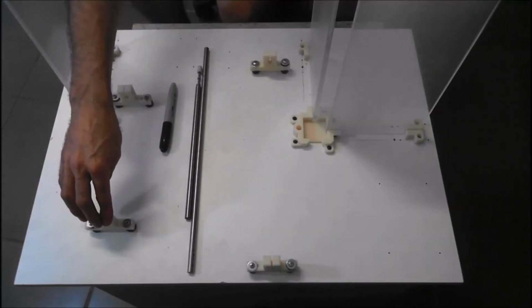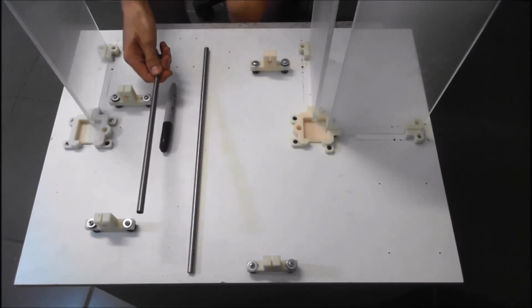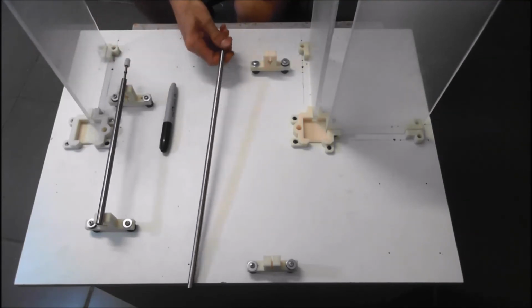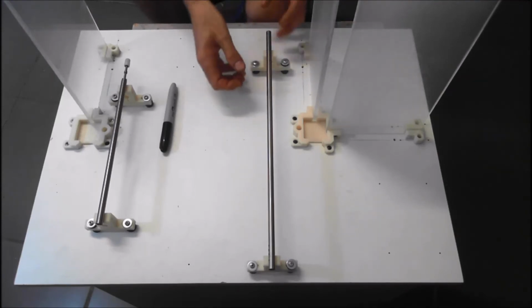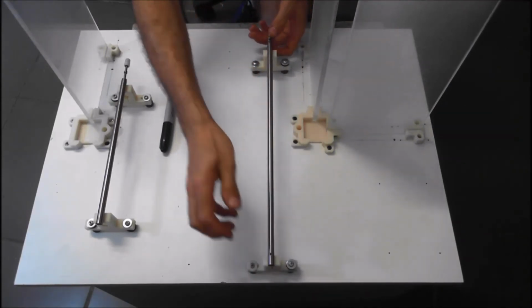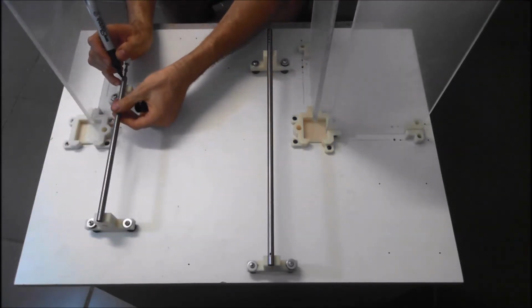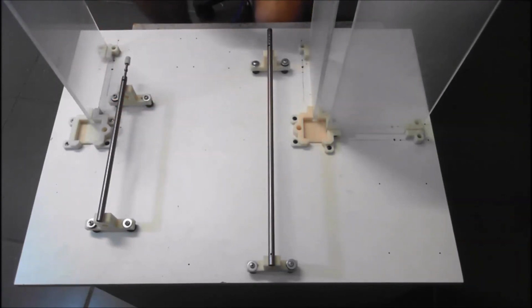So after you've mounted all your y-axis brackets, the next step is we're going to mount some of these 10 mil silvered rods. These are like chrome steel rods out of the printers. And so we've grabbed 2 that are approximately the right length, and we're just going to mark them and then take to them with a hacksaw and actually cut them down. So just decide which end you're going to cut. So I'm going to keep that. I'm just going to cut them pretty close to the length. Just put a small mark there.